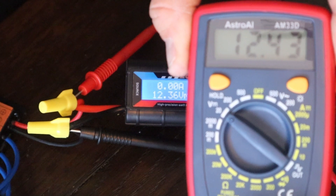These meters are probably $9–10 on Amazon — I'll put a link in the description. What it does is track how many amp-hours you've generated. You take your amp-hours times your volts — which is 12 volts — and that gives you your watt-hours, so you can figure out the cost of electricity you've saved. As long as it's connected to the battery it'll never erase, and they also come with a connection for an external power source so in case the battery dies or you disconnect it, you don't wipe your data.